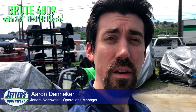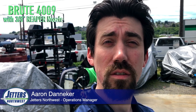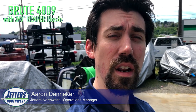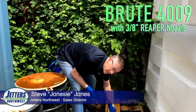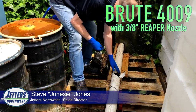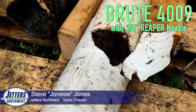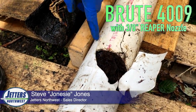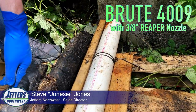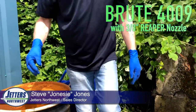We're going to try this section of pipe that he was able to give to us with our 9-gallon-a-minute, only ramped up to around 3,000 PSI, so it's more like 7.5 gallons a minute. As you can see, this thing's totally full, completely to the other end — that was like 40-plus feet, solid 4-inch. We'll start at about 3,000; if it's a little slow, we'll bring it all the way up to 9-gallon-a-minute 4000 and see how she does.